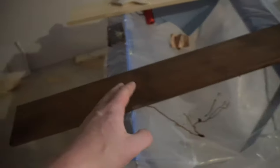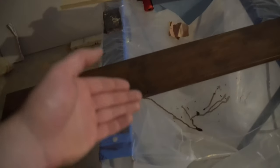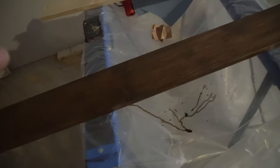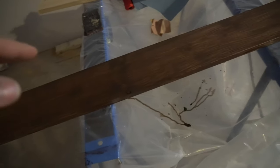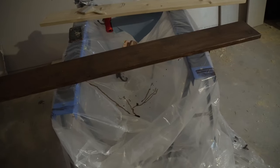Next thing you're going to want to do is don't drill your holes yet. Some people might be tempted to just say, hey, I'm going to drill my holes in the corner and be done with it. You don't want to do that yet because you have to see where your studs line up. I do suggest when going with jackets that you go into a stud, because if you don't and you just go, oh, you know what, I'm not too worried, we'll just use drywall anchors that hold 40 pounds, jackets get heavy. Put 5 jackets loaded with somebody's keys, wallets, or anything else that are in there, or a pea coat, anything like that, boom. You're just going to have this thing fall off the wall and it'll look dumb.